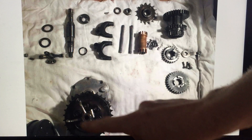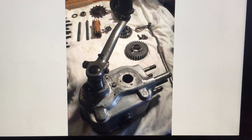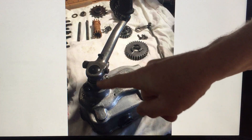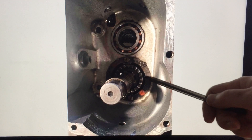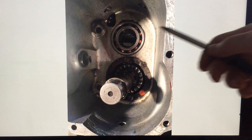This is the end cover with the clutch and primary drive sprocket already assembled onto it, and this is the gearbox housing itself. I've already assembled the kickstarter shaft into the gearbox — it's very straightforward, just a straight shaft with a return spring. When you turn the gearbox over you can see the internal side. It's basically a simple cotter pin arrangement with a bolt sitting through it and a spring going over the top. I've put a new bearing in at the top here.